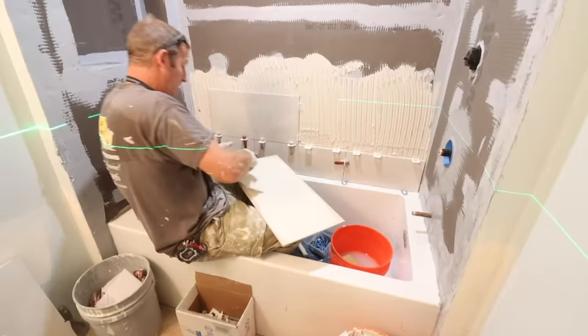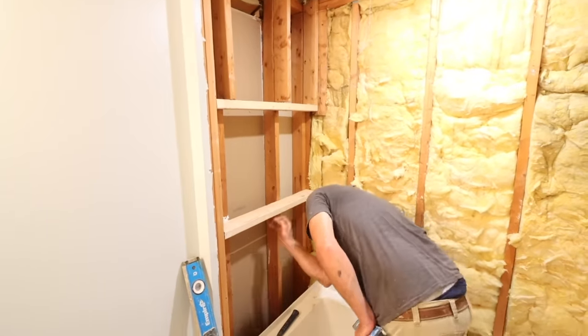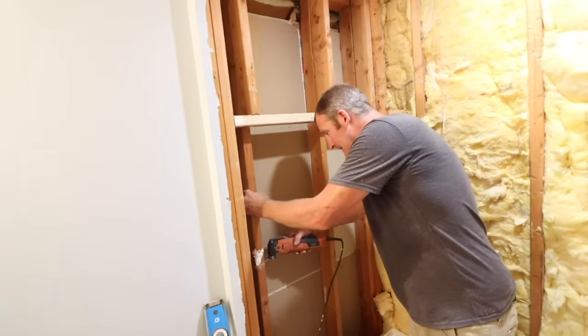The first step to installing this custom shower niche was to add the top plate and the bottom plate. Make sure the bottom plate was level and mark the location of the studs based on that, then cut out the studs using an oscillating tool and nail that in place using a nail gun. You can also pitch the bottom if you want, but in this case we made sure it was level. We applied Wedi joint sealant to the tub lip so that our cutout in our Wedi building panel would fit over top of that and be fully waterproof. Then we cut out the area for the shower niche using just a utility knife — and that's what makes Wedi awesome. We applied Wedi joint sealant to the drywall, added the cutout piece, applied Wedi joint sealant along the perimeter of the sill, screwed that in place, and along the perimeter of the sides and tops inside the shower niche. This waterproofs the entire custom shower niche so that you have a great surface to tile over top of.